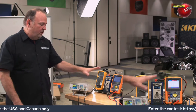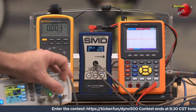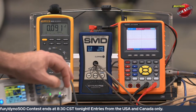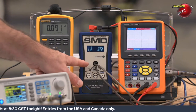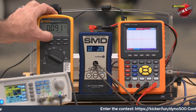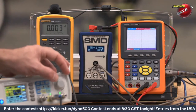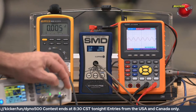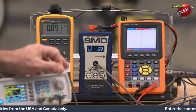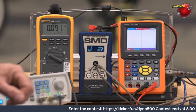Here we go. The amplifier is on, we've got everything set up, and we're going to ramp up the output voltage from the tone generator and see what happens. I'm going to bring it back down. Wow — 643 is what I see. 643 watts into one ohm, and that little amplifier drew 91 amps of current total. I'll do a reset and we'll do it again. Clipping light came on on the amplifier dyno — 653 watts, current pull 91 amps. That's not bad for a 500-watt amp.